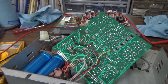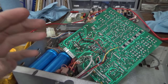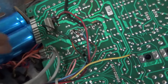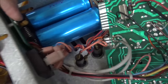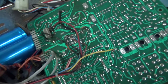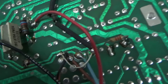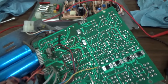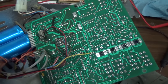I'm back inside of it and I found something. I went back and watched the video. Most of these wires are actually for the mute relay board — it uses that to mute the amp whenever it cancels the record. But there are a couple other mods, like a resistor there and a little jumper wire. This is probably stuff all done at the factory — sometimes the silk screen wouldn't be quite right, and so they just mod every one of the boards. Down here where the plug connects to the two driver boards, look at this little mod they've done.